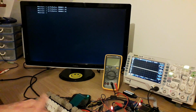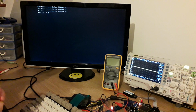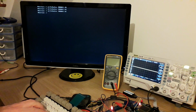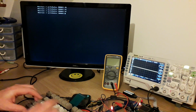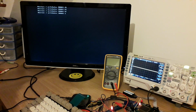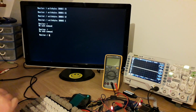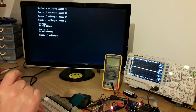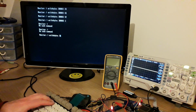There we go. Oh yeah, we've also got a mode that doubles the height as well. So all the text is, basically, each row is doubled. I'm trying to remember what the value for that one is now. 5, I think. I think that's bit 2. Sorry, bit 1. There we go. And doubling up the horizontal is a lot harder, but I might do it one day. But the actual 68000 itself doesn't know that it's in doubled up mode, so the scrolling will be completely screwed. So let's switch it back.